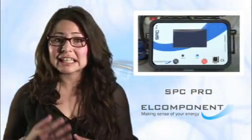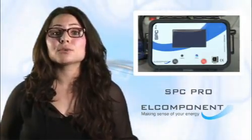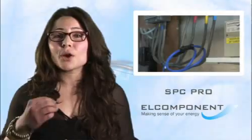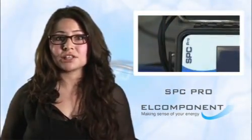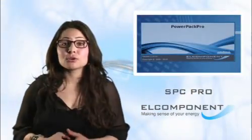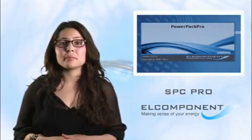As we'll demonstrate, these are really easy to use, but they're also extremely accurate and, well, flexible, because as well as being readily fitted around awkwardly shaped cables and into tight spaces, they allow the instrument to be used on loads as low as 2 amps all the way up to 2000 amps, without any manual range selection required. That's real flexibility.